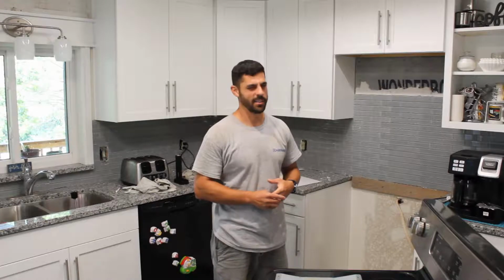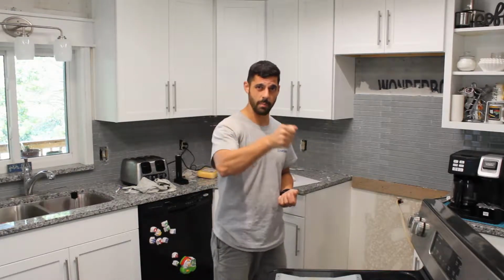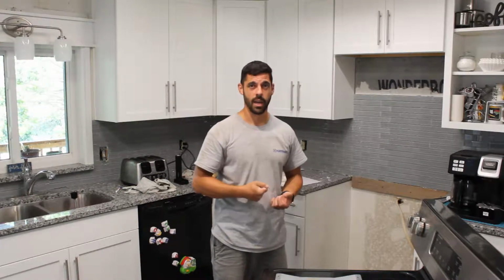A lot of people really hate the grout process. They say it just makes a huge mess and they get tired of grouting and wiping and grouting and wiping. If you find that during the grouting process you're just making a huge mess, you're having to wipe up way too much grout, chances are you've got too much grout on your float or too much grout in the grout lines. So what you really want to do is take that grout float and scrape off all of the grout, and what's left behind is just what you see in the grout lines.